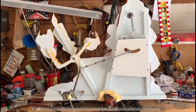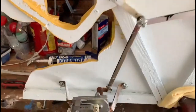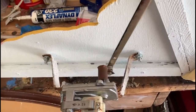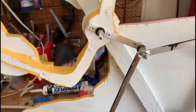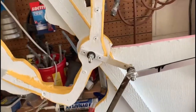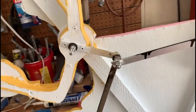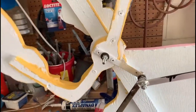With this video, what he's showing us right now is that he's using a single AC rotisserie motor. We'll talk about motors here in a second. What he has there is a single spacer that allows it to move freely with a single camshaft or cam arm that's going up to his first pivot point. From there, it attaches to his candle guy that is fixed. The point is fixed onto the candle. So when that pivot point moves up and down, it constantly rotates the arm of the candle.